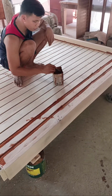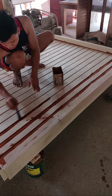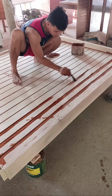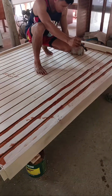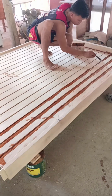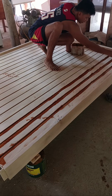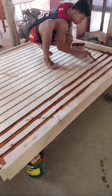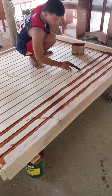The color of the wood stain depends on your mixing ratio. I mix three oil wood stains, namely the burnt umber, burnt sienna, and then the raw sienna. You can also use only one wood stain or painting color. Let's say for example you only use the burnt umber. It is a dark brown color, or it looks like a chocolate brown. If you want to make it a little bit darker, you can add lamp black.